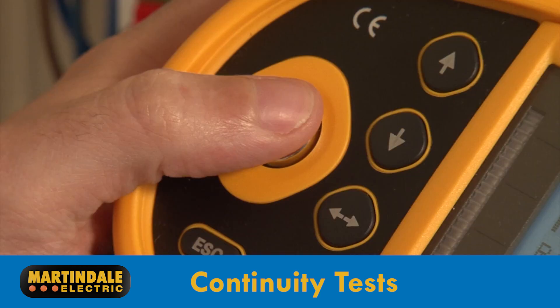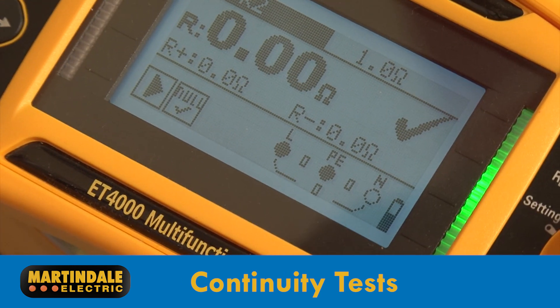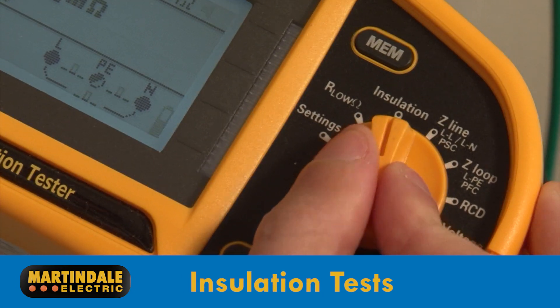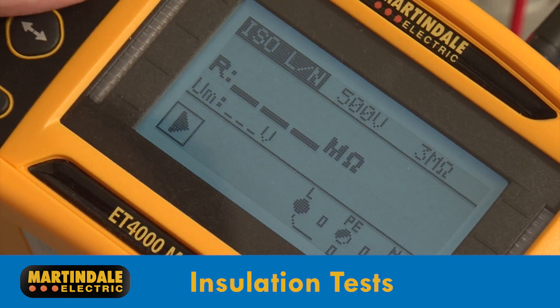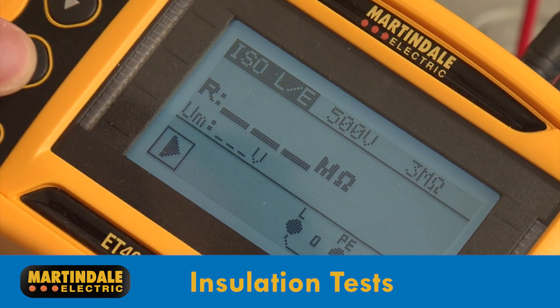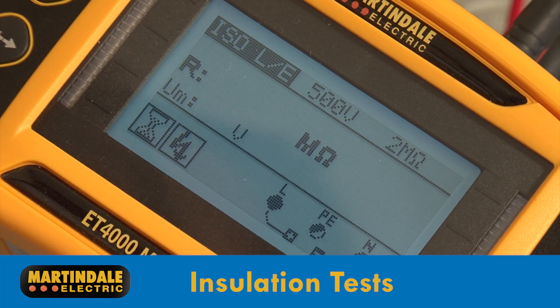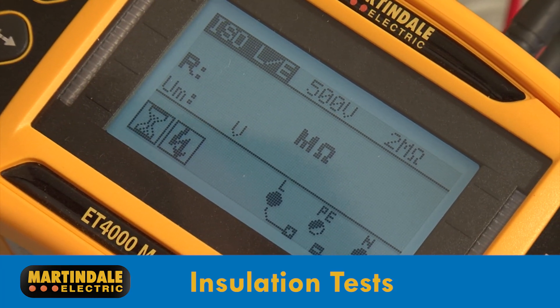This will enable the red or green pass-fail indicators beside the screen. For insulation tests, you can select the test configuration and voltage and, again, your desired pass level. This could be as low as that specified in BS-7671 or a more realistic level for newer installations.